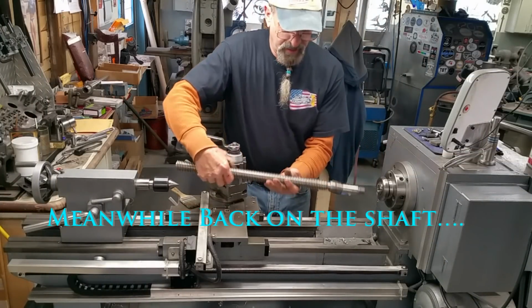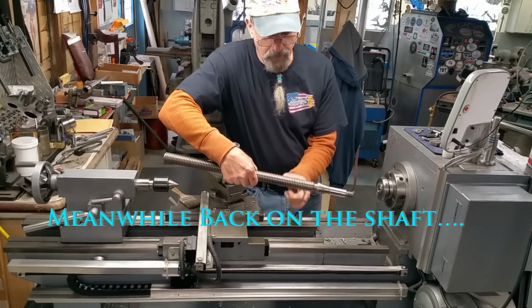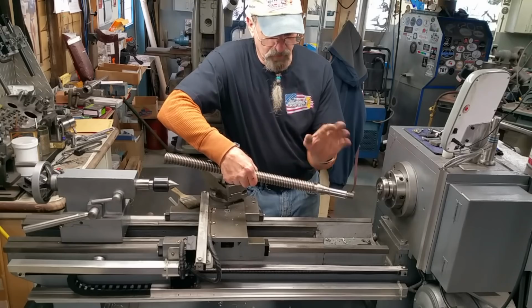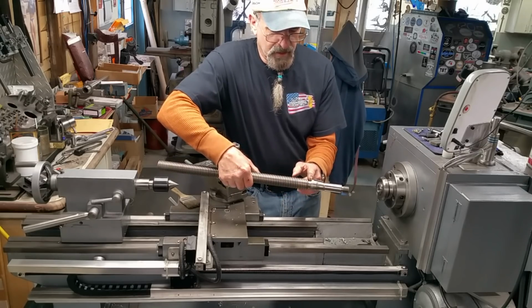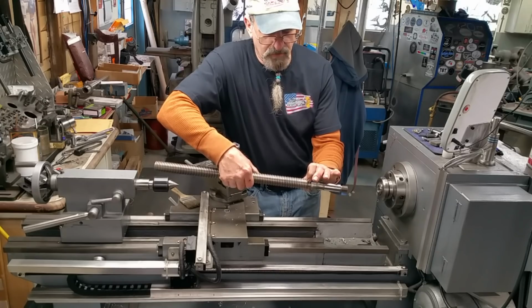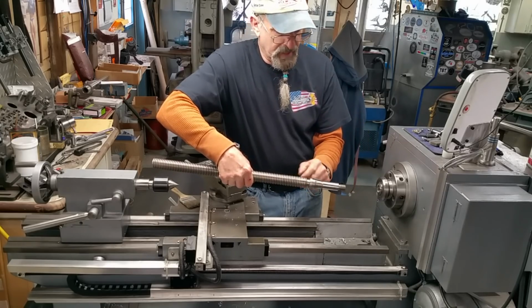Okay, we brought the lead screw in here just for the final touches. We had a slight little bend in here, and we were able to, with one punch of aluminum under here and one piece of aluminum here in the hydraulic press, get it right within a couple thousandths, and this is running really, really true. Now, here's our biggest bend, where there was the least support from this part of the rod and the bearing support here, which created a bend.